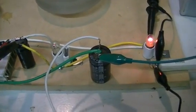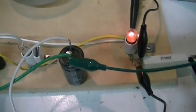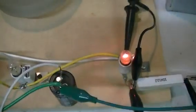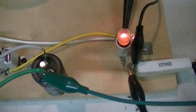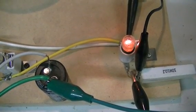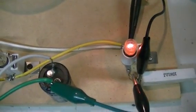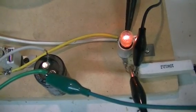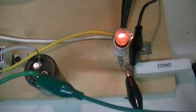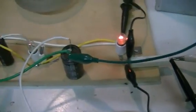This is what I was trying to say to the other guys that are doing a lot of power measurements using CVRs: your CVR may be seeing one thing, but that's not actually there — because you simply cannot get an incandescent bulb to glow brighter by sending less current through it, or less power through it. Current through it and voltage across it both have to climb in order for that bulb to dissipate more light and heat. But in this case it is the opposite, and it deserves a little further looking into. Cheers, guys.